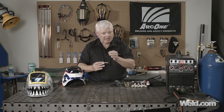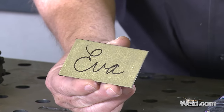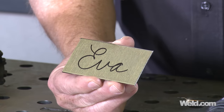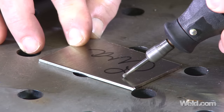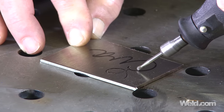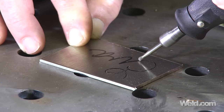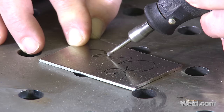One of the things to keep in mind is when you're welding on a buckle, you've got to be able to see exactly what you're going to scroll out. So what we did is we selected a name that looked kind of good on the buckle, and you mark it out with a black felt tip. We picked out the name EVA. Once you print this out, if you don't get it centered just wipe it clean and do it again. I'm going to put on my safety glasses and I'm going to scroll right over the top of this using my Dremel. I'm going to act like I'm grinding and follow this perfectly. Once I do that, then under the hood I can see it and I can weld.